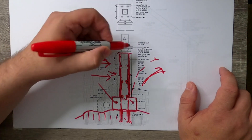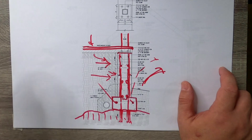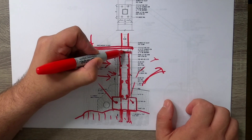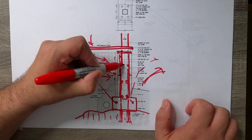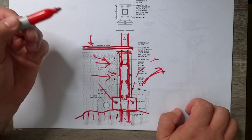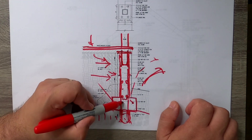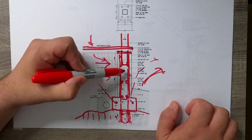The wall stops intentionally at a level below the stone pavers, which are the finished floor. We want the base plate to be below that so we don't see any bolts or plate or mechanism — just the clean five-and-a-half-inch column passing through the stone, disappearing cleanly. The base plate is about 12 inches square and three-quarters of an inch thick. The anchor bolts come down into it and are bent like the letter J. So: ledge to footing via epoxied rebar, footing to wall via bars, and those anchor bolts connect the base plate to the foundation wall.